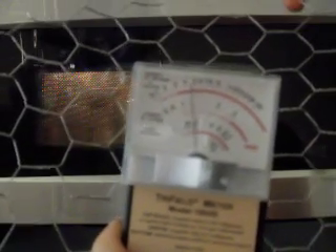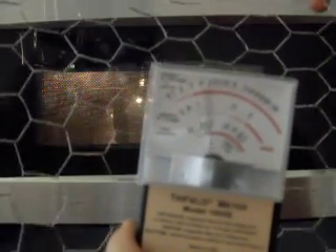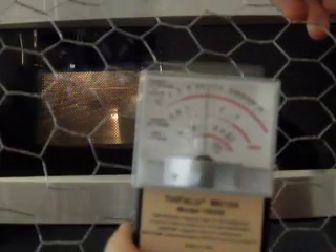So a lot of homes are built with stucco chicken wire. Let's see what that does. It doesn't really do anything, and that's because the holes are too big. If these holes were the size of the holes in the screen of the microwave, then it would provide a very effective shield. The stucco doesn't really work because the holes are just far too big and the microwaves just pass straight through them.